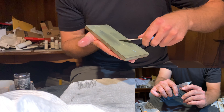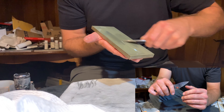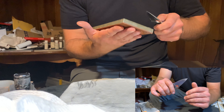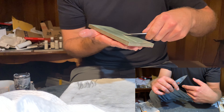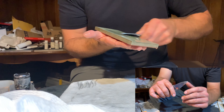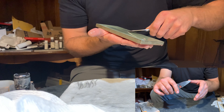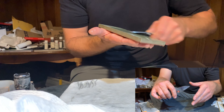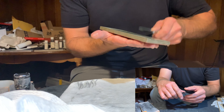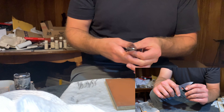At this point in the sharpening, I moved on to Venev's OCB resin-bonded diamond waterstones using their 7 to 5 micron stone, or 800 grit stone. Their 800 grit is different than other systems' 800 grit — what's relevant is the 7 to 5 micron rating. I've been using the Venev OCB stones as my final finishing stones when doing high-carbide steels, and very much enjoying the performance I'm finding out of them.